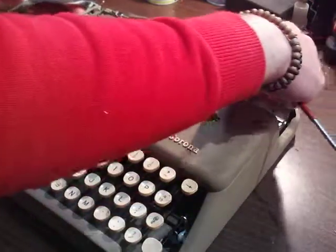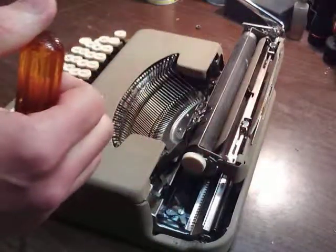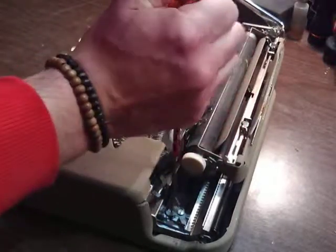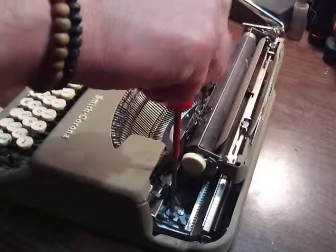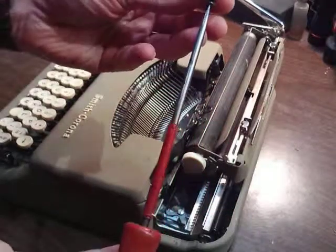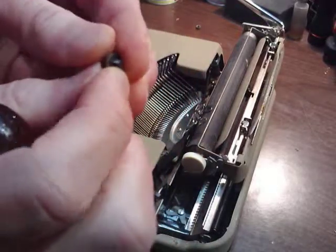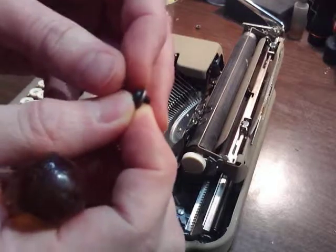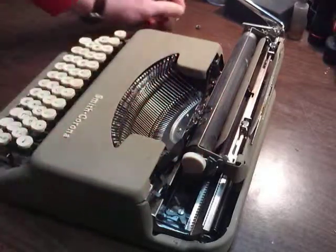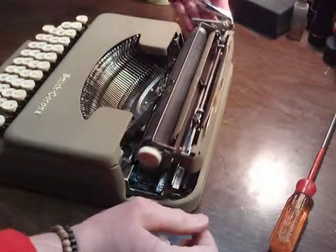We'll do the alternate side. You've got to get down between all this. That's shift linkage. It makes the carriage segment shift. And get that guy up. Come on, baby. Good. And try and keep it together. It looks like you'll have a little hollowed side to this spacer washer as well, and that will face down, the open side of it, in case you drop it off. Now, this guy should just pivot out of here.